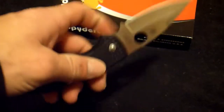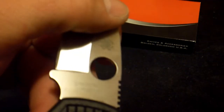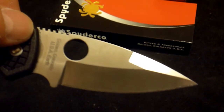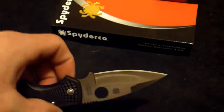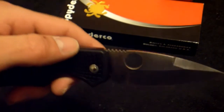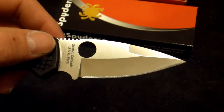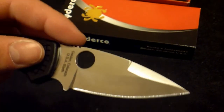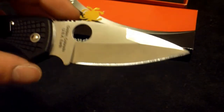What makes it cool is it utilizes vanadium carbides, which are harder and better for cutting than chromium carbides. When they're making the steel they try to get as much vanadium carbide in there as possible. There's four percent vanadium carbide in this steel, 14 percent chromium, 1.45 percent carbon, and two percent molybdenum.